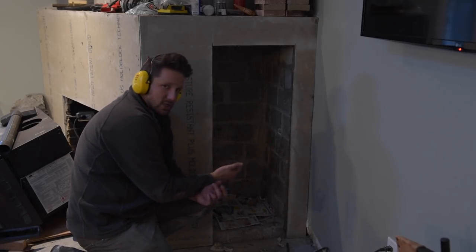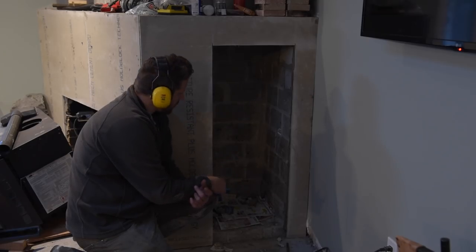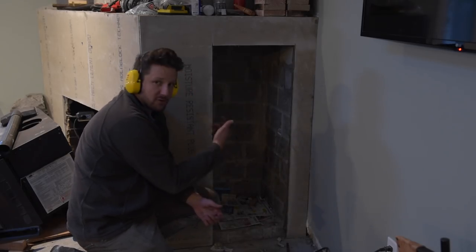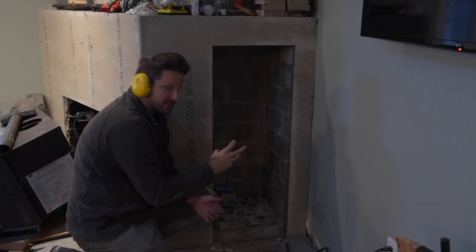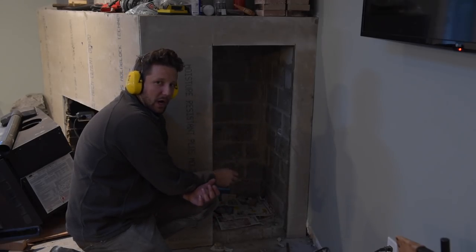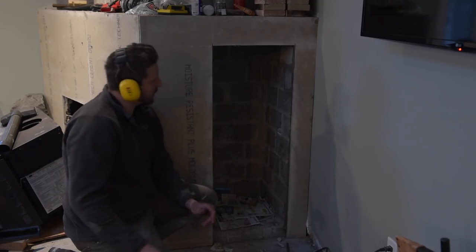So what I'm going to do is I went to the metal supermarkets, got some sheet metal. I'm just going to put sheet metal in here and weld the corners with some angle iron, spray it with vinegar, and that vinegar will cause it to rust really heavily. So it'll be like a rusted industrial kind of steel box where the wood sits. So that's a quick fix. Let's go weld that up right now.